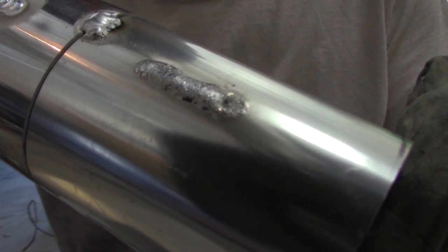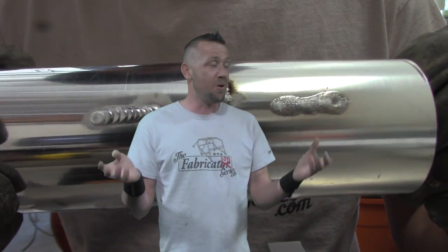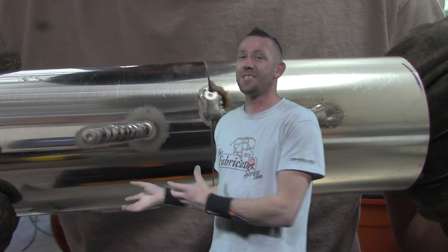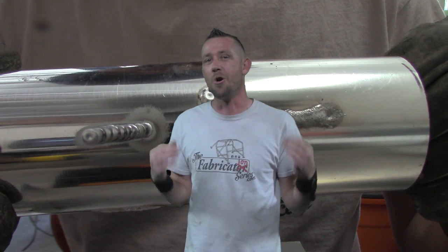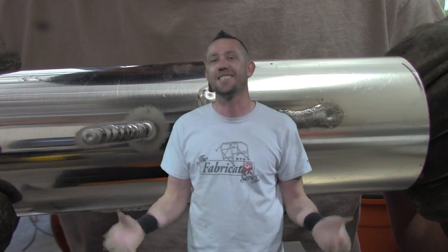Here's the Mystery Metal. Right off the get-go we had a really funky arc start, and as I weld here you kind of notice that it's leaving something behind that doesn't really look anything like a weld. At one point I'm having to force a ton of filler rod in there to keep it from blowing through. That's about the time where you look at it and think something in there is not aluminum — that's just not right. And you didn't suddenly become a bad welder just out of nowhere, so what is that?